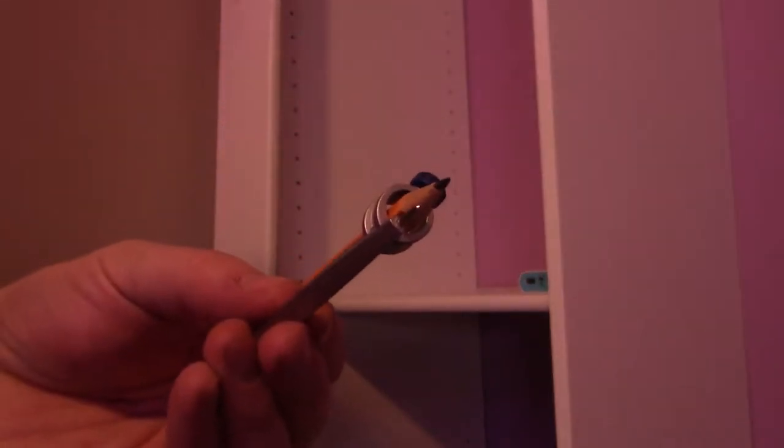Since corners in drywall are always filled with plaster, I couldn't have the cabinet installed while touching both the back and side walls at the same time, so I opted to back them fully into the back wall and fill in the gap along the sides.